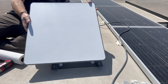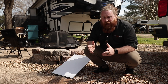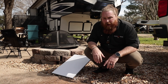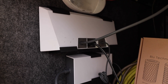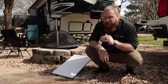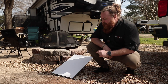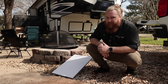The Trio Flat Mount is still not really designed for in-motion high-speed use. If you're really looking for something that can withstand that, that's what the high-performance dish is all about — it comes with the correct hardware, and the install kit is designed for in-motion roof-mounted applications. With the high performance, you don't even need the Starlink router if you're going to a Peplink — it comes with a power module and Ethernet that goes right into the Peplink. With the Gen 3, you're in a wiring situation between the power adapter, router, and getting the router into bypass mode before connecting to Peplink. The high performance is still my go-to solution for better and faster performance with a better field of view.